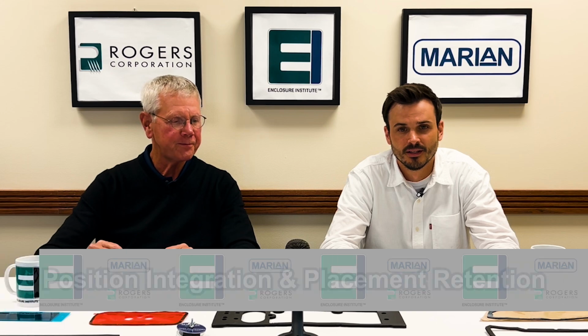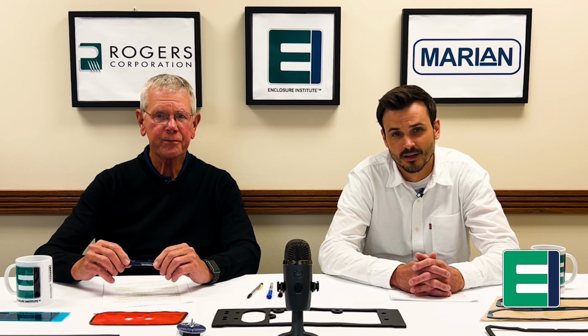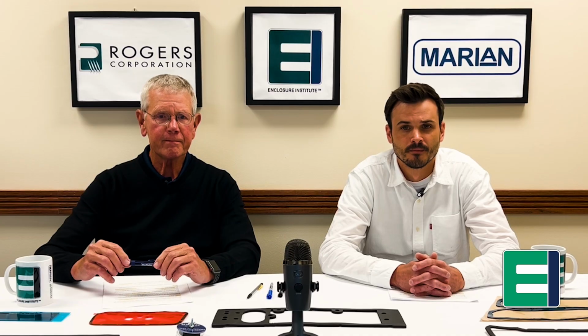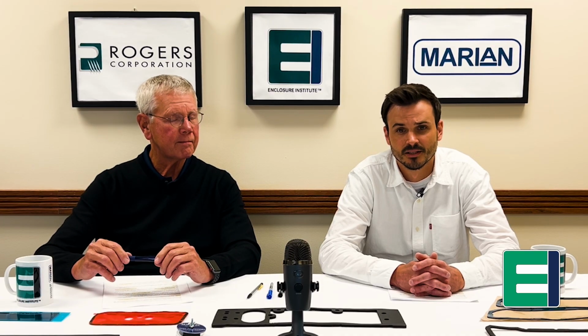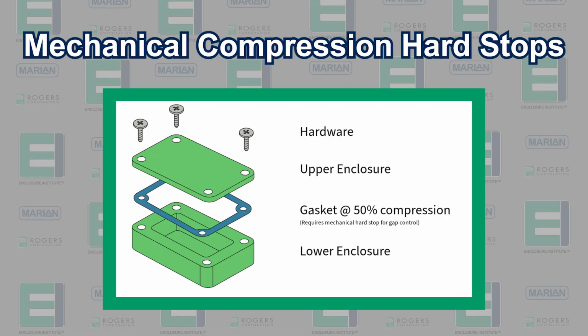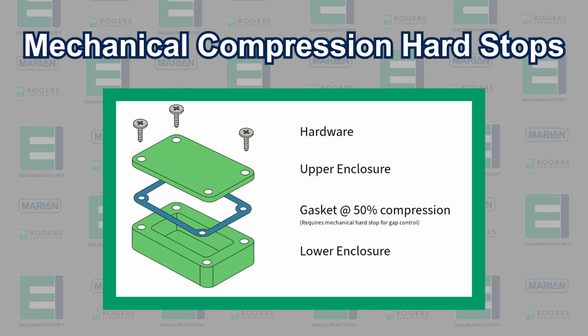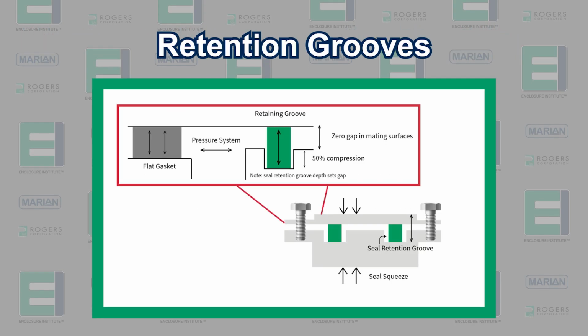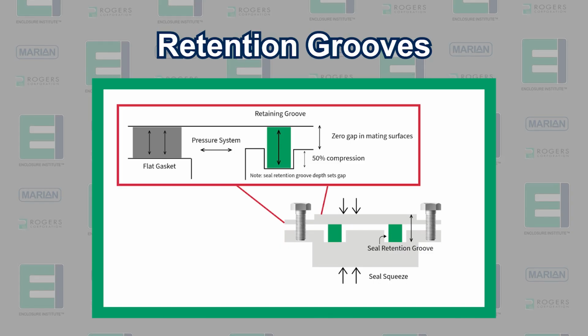Gaskets that are not accurately installed or securely retained can shift out of place, leading to leaks, uneven compression, and premature failure. This is especially true in high vibration environments, dynamic sealing applications, and enclosures exposed to pressure changes. To protect against these types of problems, you might incorporate mechanical compression hard stops to ensure consistent gap control. You might also add retention grooves to maintain gasket placement and alignment during operation.